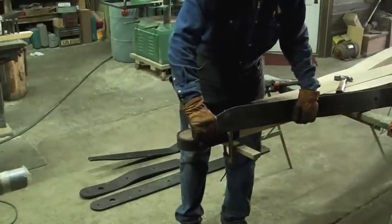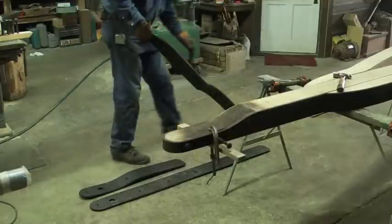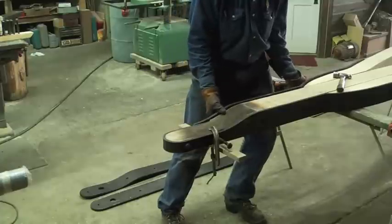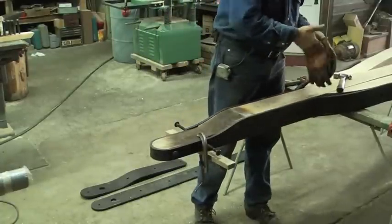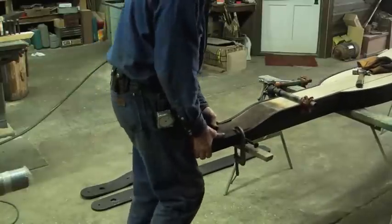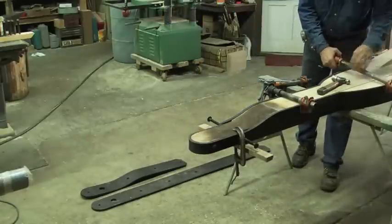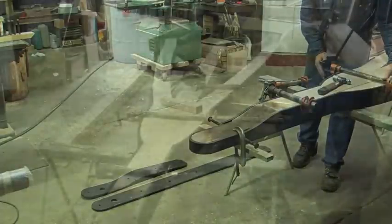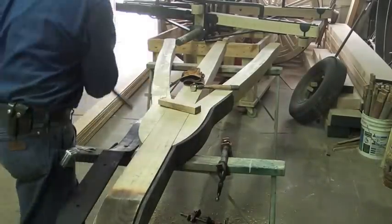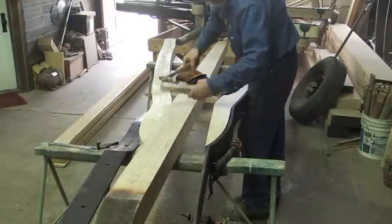The side irons are shaped for the curve of the reach and also shaped where the reach hounds need to come and attach to the reach itself. We're going to pin these in place at the front of the reach but actually start assembling them at the back. We clamp these irons in place with them pinned, then shove the reach back, bringing the reach hounds into the iron where they need to be finally assembled. We clamp them in place, drill the back holes, then take it apart and attach the side irons to the reach hounds first before working forward.